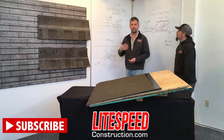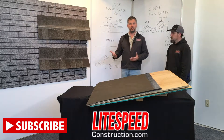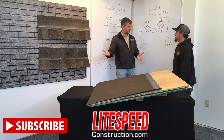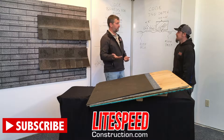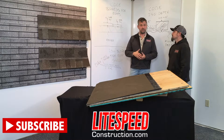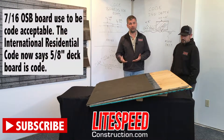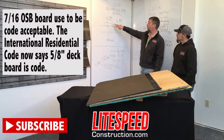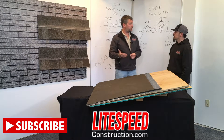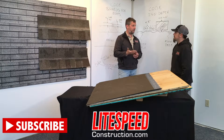For example, if somebody has an old roof and a tree falls through, damaging a few shingles on a 7/16ths board, your insurance company may come out and say let's just replace the board and put a few shingles out — and they want to pay you, say, $500, which will be less than the price of your deductible. One of our contentions is that code is going to suggest we cannot put a 7/16ths board back on your roof, because there'd be a gap between your 7/16ths and your 5/8ths. So the insurance company would actually be on the hook to buy the whole roof, in our opinion, and we would submit that to them on behalf of our customers.